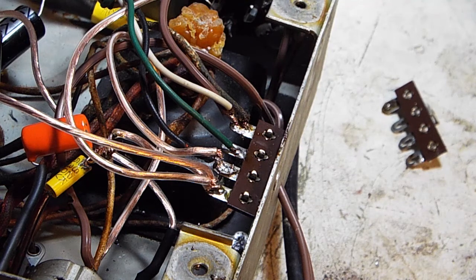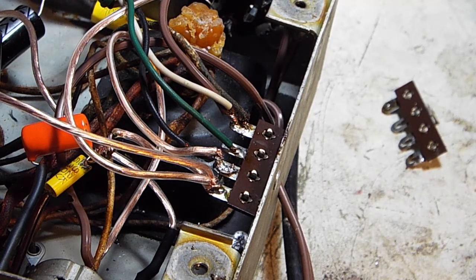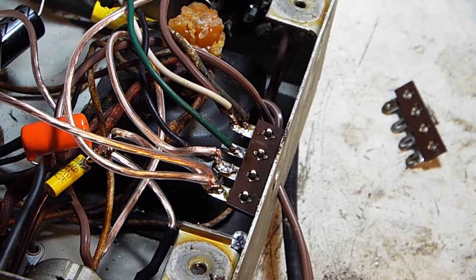And then from there, I'm going to bring down the speaker down here, unsolder some stuff, and then solder my jumper leads, so this way I can test the other speaker, just to be sure this is working. I want to make sure everything's in line, in order, not all of a sudden I plug this in, it doesn't make any sound, and I get all depressed that it's not making a sound, when it could just be that the speaker leads aren't right. So I'm going to go put this back up there.